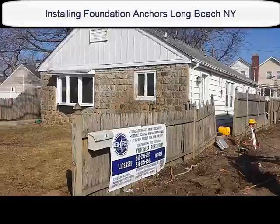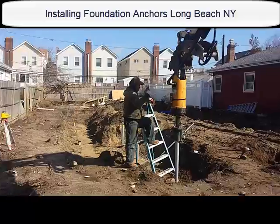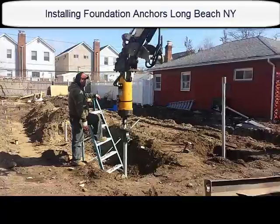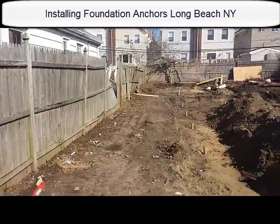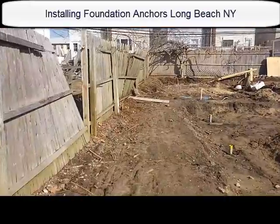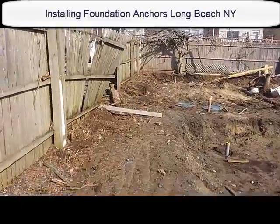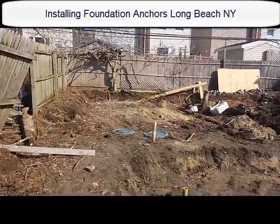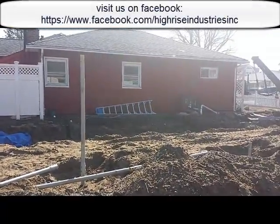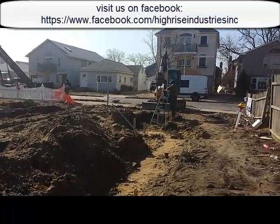What we're doing is installing 22 pilings. It's a single story house that's going to be elevated about 10 feet off the ground, with every pile about 8 feet apart. All these pilings have been installed already — we started here yesterday, and now all we are missing are the middle caps and the final front 5.